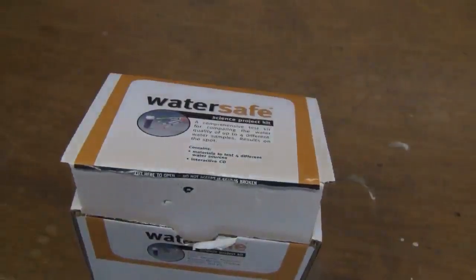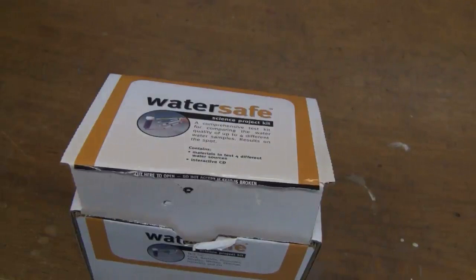Hey everybody. One of the first things you want to do with your well water is have it tested. In the area I live in, there's a propagation of salt water intrusion. I live on the Gulf Coast, and that would be the first thing you need to test for. I had to take it to a local lab that tests the city's water and check it for salt water or sodium content. The EPA suggests that the limit would be 20 milligrams per liter of sodium in your water. I had mine tested and it was 18 milligrams, so I'm in the safe zone.